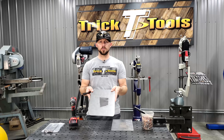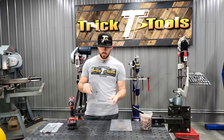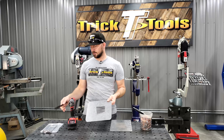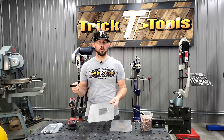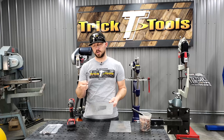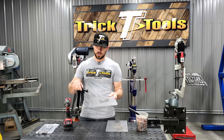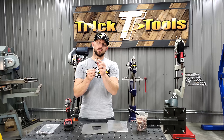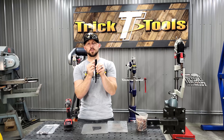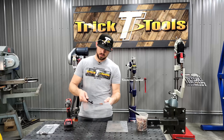Imagine this as a panel that you can't get to the backside — so all you can see is what you have here. I've already got some holes around here, so you take one of these. We have different sizes — that way it fits different size bolts or drill sizes. This is an eighth-inch size, or number 30, for being able to find an eighth-inch hole. There's a pin on the backside that sticks out the size of the hole, and then there's a drill bushing on the other side.